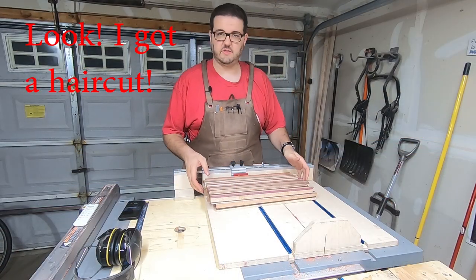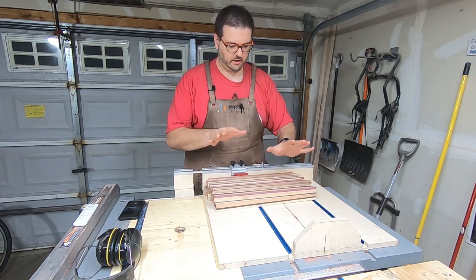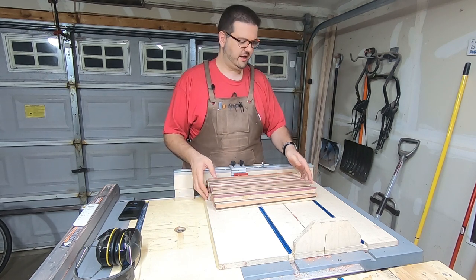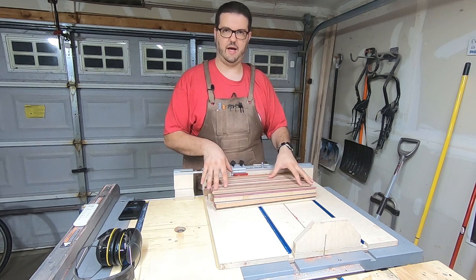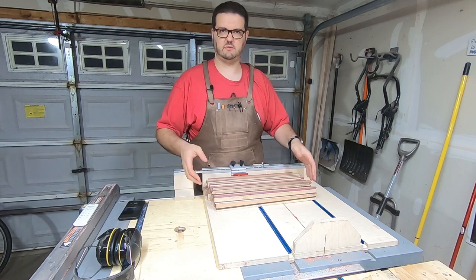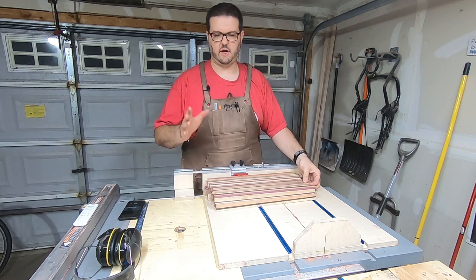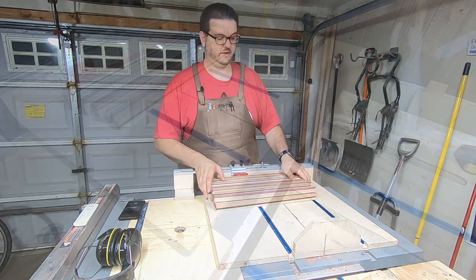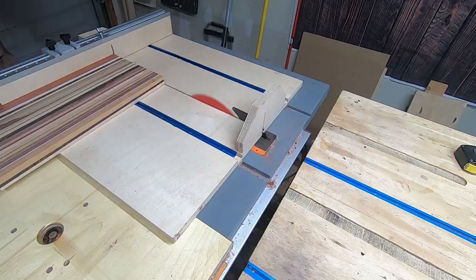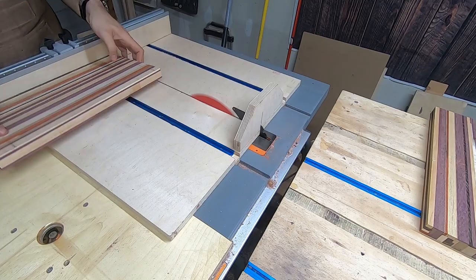After six glue-ups, we finally have our final pattern. The next things I need to do are square off the two ends to get rid of all these jaggies — that'll let me know how much material I have to deal with for making the pieces to flip over for end grain. I'm going to do that on both of these, get both ends done, run a calculation, and figure out how many strips I need to make a couple of boards. I'm trying to take off the absolute minimum to square off the ends, so I make one main pass, then a second more accurate pass on each side of each board.